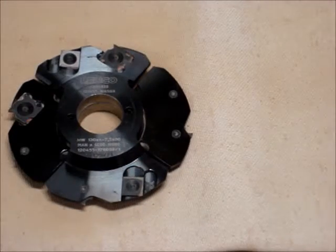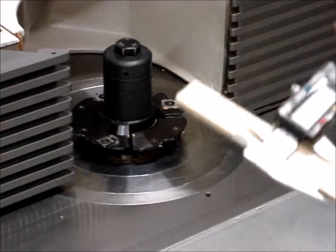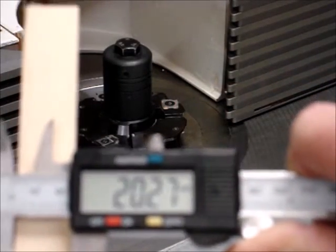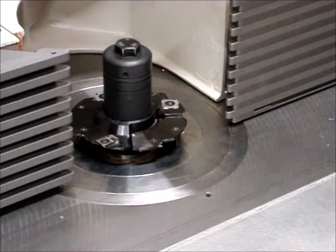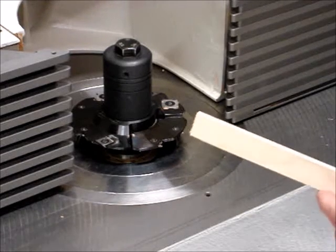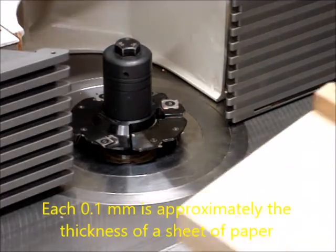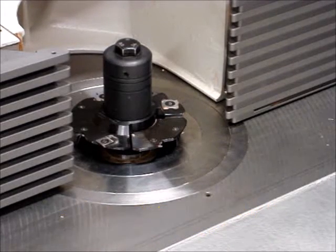Now I've got the width set. My spline has a width of just over 20mm, so I'm just over 20mm. I want to go into each piece roughly half of that. Considering my total thickness to make sure the two pieces close up on each other, that's 20 — or half of 20.5mm, which would be 10 and a quarter millimeters.